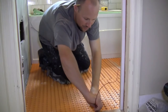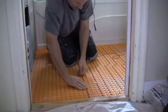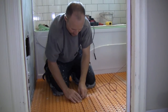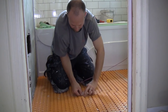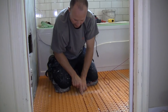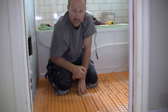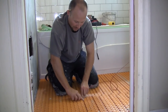It's always easier to pull out a bit of cable first and then work with it. If you're making a run longer than 10 feet, make sure you do — I can't remember the exact name for it — but something like a small kink or loop right there. What that does is allow for expansion because this cable does expand and contract a little bit. If you keep it straight the whole time, there's too much tension on it. I don't know the exact reason, but they recommend you do that.